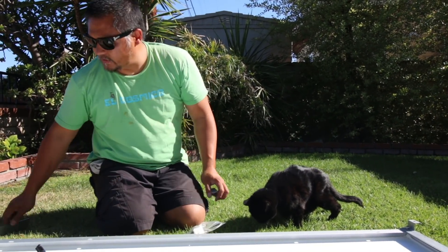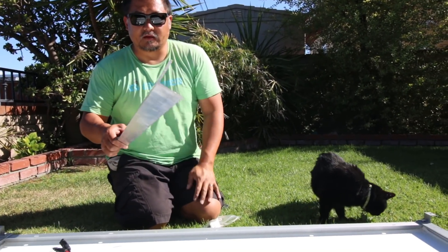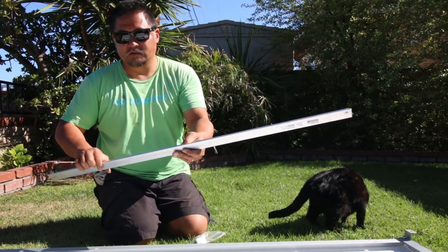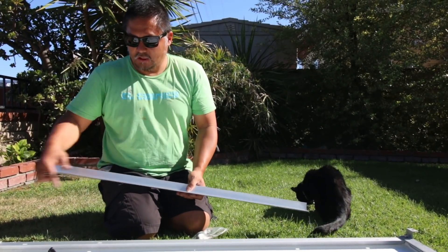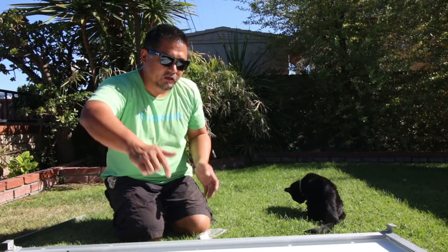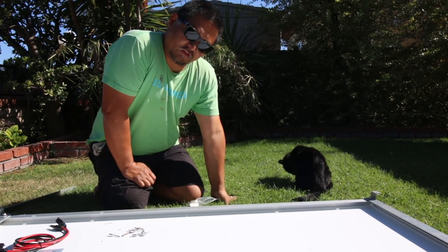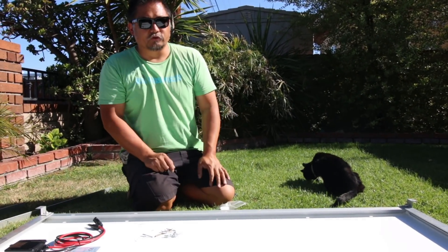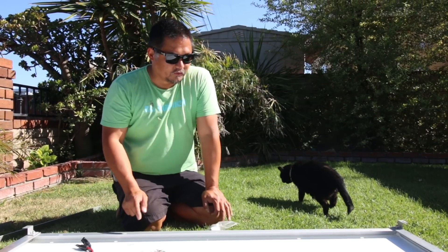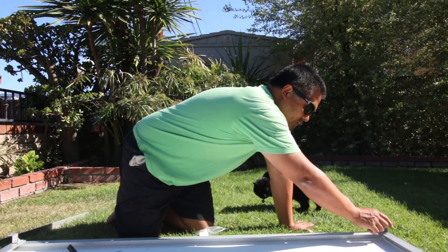What I did is I got these extruded angle brackets made of aluminum — heavy duty ones. These are like 40 to 50 bucks, and they're 8-foot pieces. The solar panels are 58 inches long and about 26 inches wide, so from edge to edge here is almost 53 inches, and the tracks on the roof from center to center is 52 inches. So this is going to take up pretty much the exact amount of space I'll need on the roof — it had to be pretty precise.